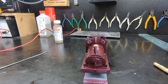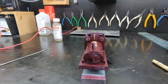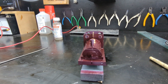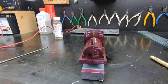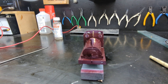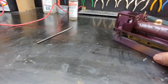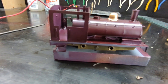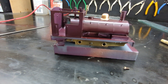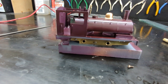I've got some brass rod and I cut thin slivers and put it around the spectacle plate windows. I still haven't taken it all back to brass but I want to tart that up. The roof I've made to come off - I soldered some wire across it and I've got four spring clips, so I can get into the cab and make it good. I did add some old white metal springs as well.